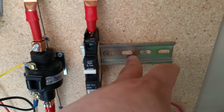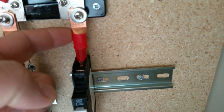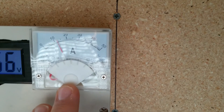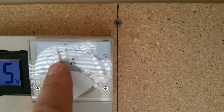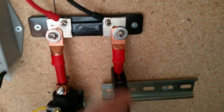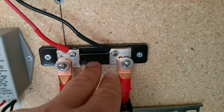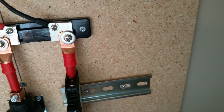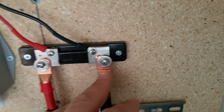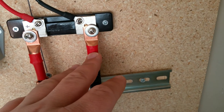This is on a DIN rail mount and runs up to a very short two gauge wire that goes to my shunt, which is used for this meter right here. It's early morning, about 10:30, and I'm putting out about 12 amps DC. This is a 75 amp, 75 millivolt shunt — it lets me see the amperage running from the system. This is pre-production, raw input from the panels, so the panels are generating 12 amps right now.